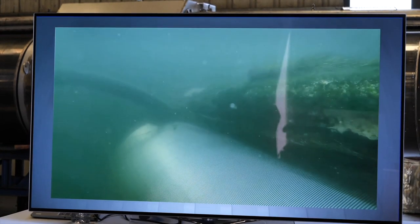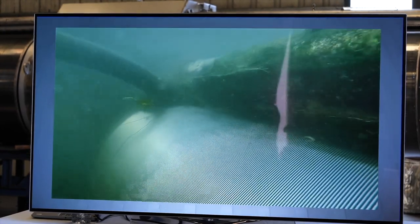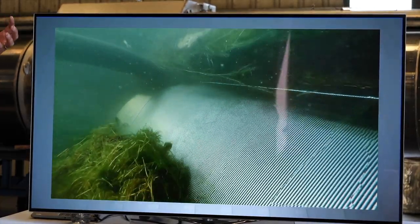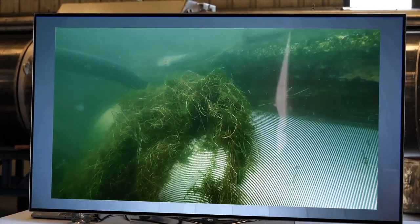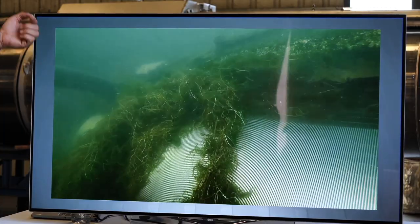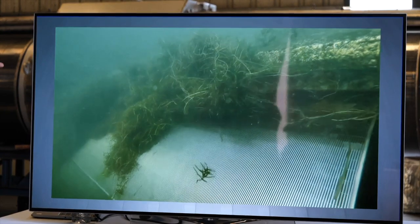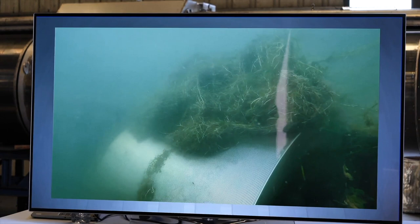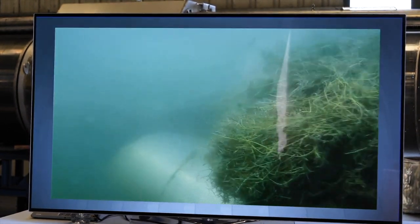There is a water backwash system on this screen. They're pumping water up a hill, and they have all this back pressure, so they have a surge chamber. We tapped into that surge chamber and ran it back down. When the screens run, a valve opens and water jets out, and that's what you see. You can get this ball of grass, and it'll hit this jet of water, and it kind of blows it away from the screens. This is in a river, but it's in a back eddy, so there's not a lot of sweeping flow. So there's this supplemental jetting system to help move any debris downstream.